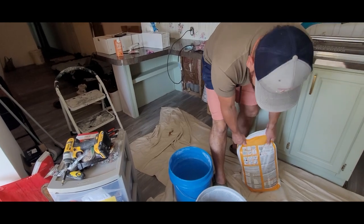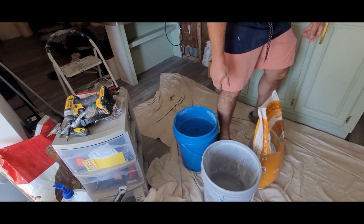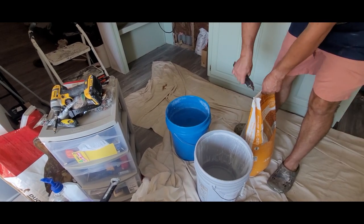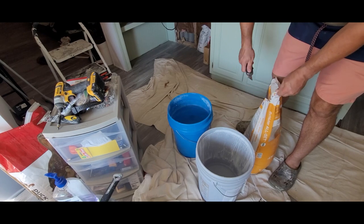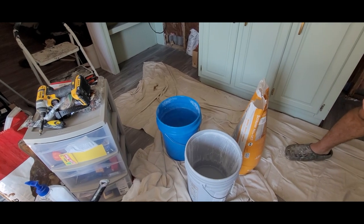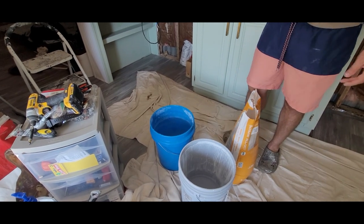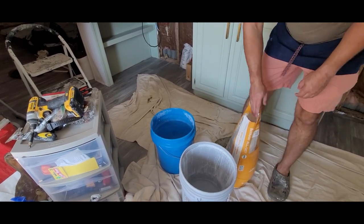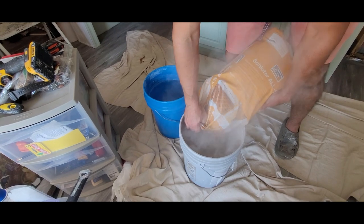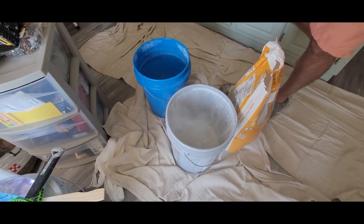He said that the cement, you gotta make it sticky. Can't make the cement neither too dry or neither too runny. Not as thick as peanut butter, so a little bit smoother than peanut butter. Like icing. Not as thin as whipped cream. We'll show you the consistency here.